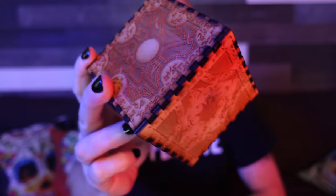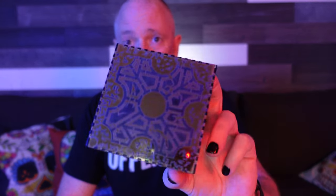This box right here, there's no glue on this box. It'll just pop right open. See that? The reason it can friction fit together like this is because I dialed in my kerf before I cut the box. Same thing with this thing right here — those finger joints are just friction fit together. This is not glued together. I don't want to take this apart because it's harder to get back together. So before we get to the inlay, I'm going to show you how to figure out what your kerf is.